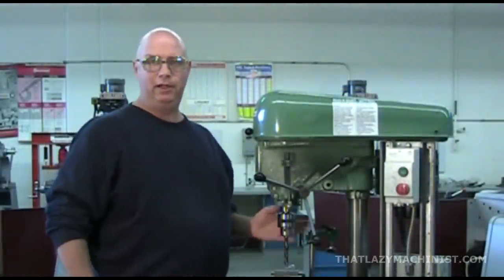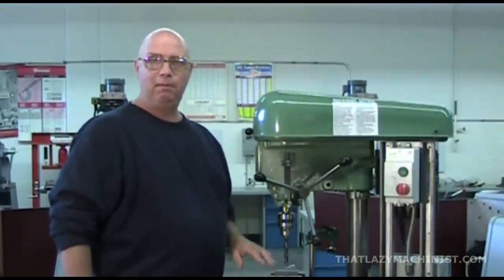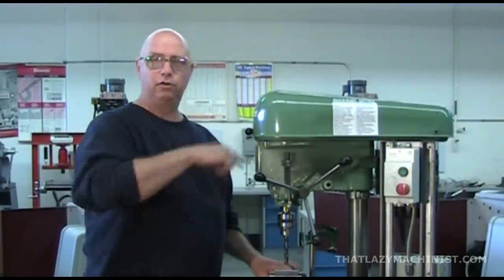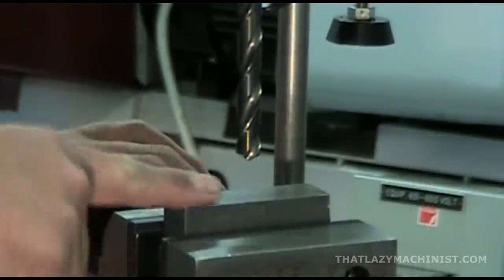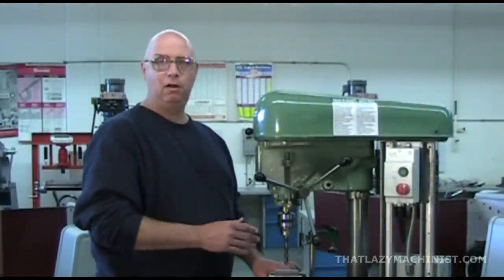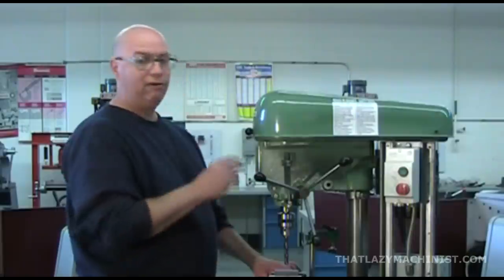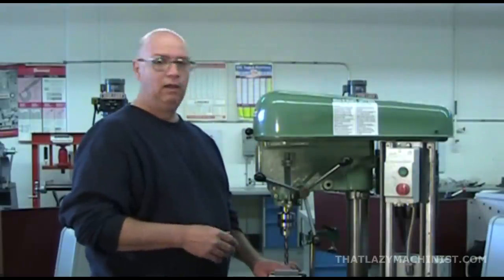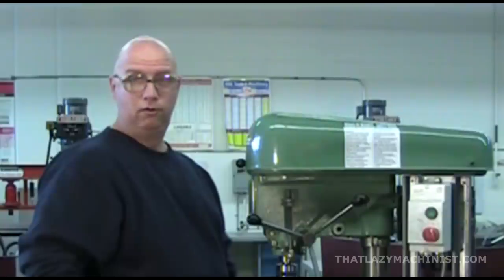I've mounted my drill in a drill chuck in this drill press. I've also found a piece of scrap steel and mounted it properly in a drill press vise that's firmly leaning on a stop so that the vise can't spin around if ever this drill catches in the hole that it's producing. Now, the piece of steel that we're going to be cutting is a piece of 4140, which is a medium carbon alloy steel. It's pretty tough stuff, so this will give my drill a good test. I've got my RPM set at around 400, which is at the lower end of the speed that I'm looking for, but I don't want this to spin too rapidly because I really want to see how the drill is cutting. So let's drill.